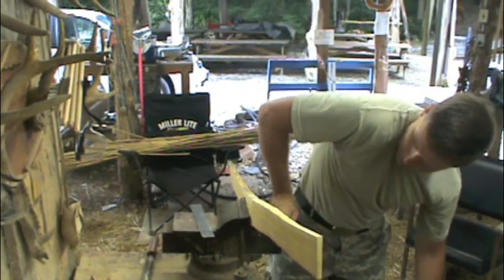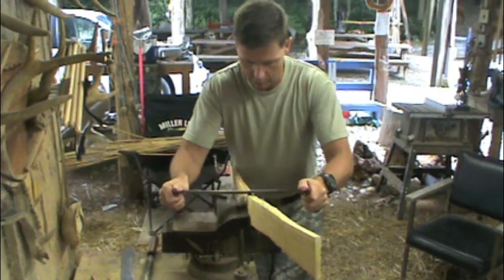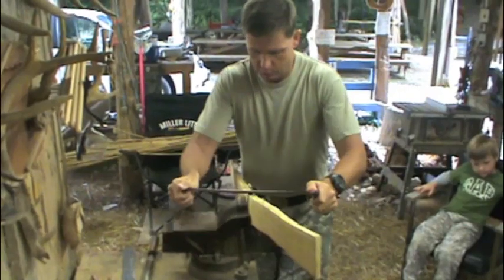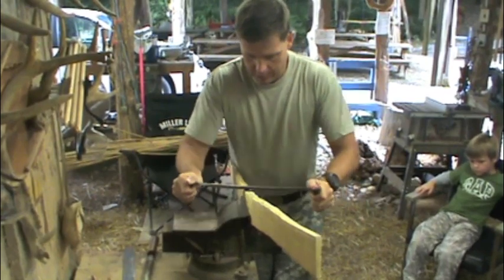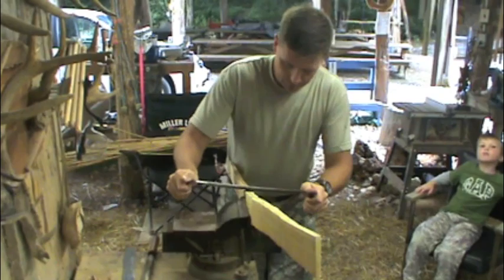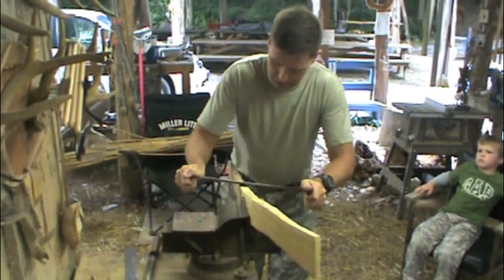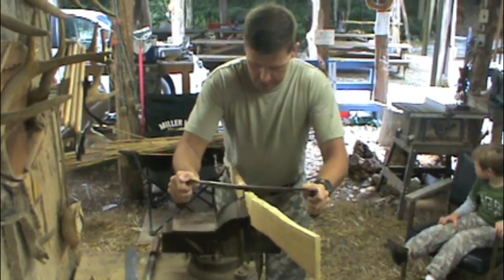I'm just doing it with one ring for demonstration purposes. Obviously, we've got to go quite a ways down. If you were chasing a ring just on a piece of wood, not getting rid of the sapwood, but chasing one ring to get to the ring you wanted to use to make your bow, then this is how you would do it. And obviously, I'm going to go ahead and take about half of this sapwood off on the next run. It's still in growth rings. You can clearly see the rings. It grows the same way. It's just that the sapwood's thicker and a little bit softer.